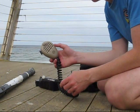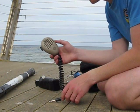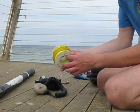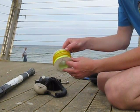Also got the microphone. This came out of the Stone Age, and if you wanted to make the station smaller, the first thing you'd do would be to replace it with an electret. Here's the wire antenna, an end-fed wire 20 metres long with some rope attached. Again, if I wanted to make it smaller, I'd use fishing line instead.